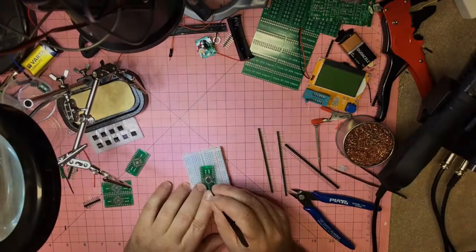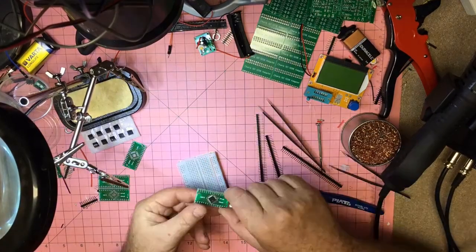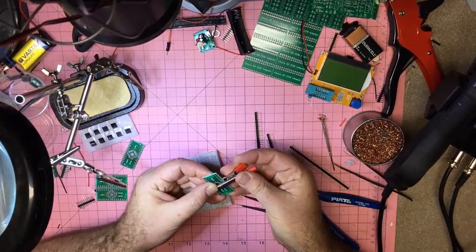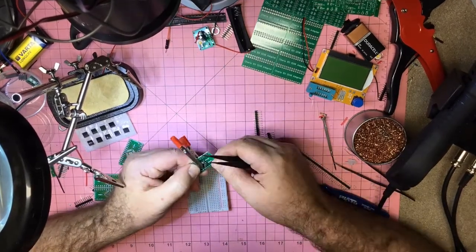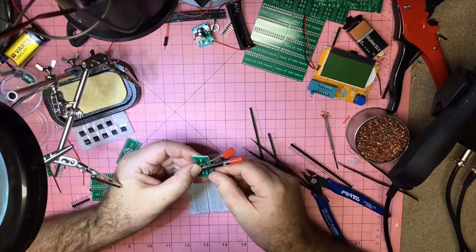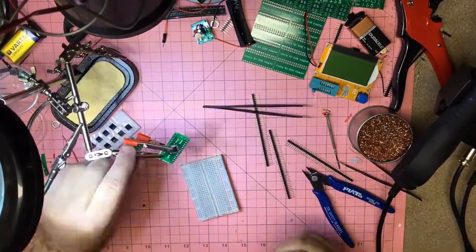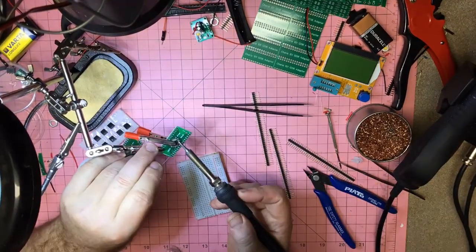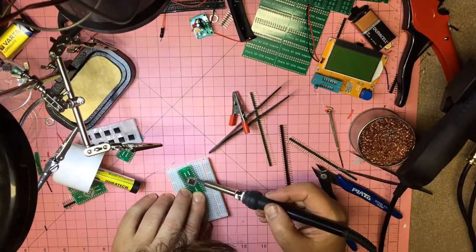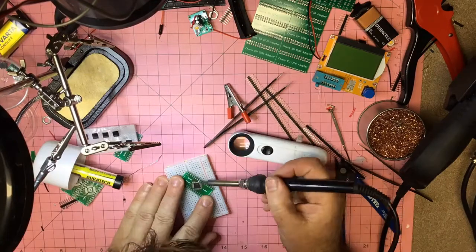Let's put this chip onto the wide-form adapter — it's called a QFP32 adapter. It's a 32-pin chip, so I'm just positioning it here. The first method I'm going to use for attaching it is a standard soldering iron, which is my preferred method, although due to a little lack of practice lately I got quite a few bridges when I did this particular one.